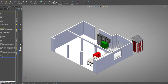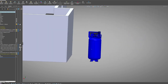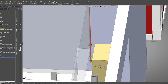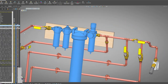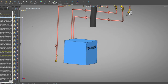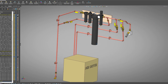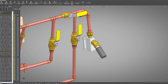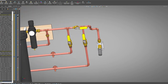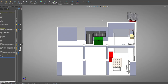Using my favorite 3D CAD program, SolidWorks, my setup starts with a two-stage 60-gallon air compressor to handle the demand for the plasma cutter. It then goes into the shop to a five-stage air desiccant filter that captures moisture, particles, and oil before it goes into the dryer. Then it goes into the refrigerant dryer, which cools the air even more and causes the water to drip out — you can compare this to a dehumidifier used to dehumidify a room. Air is then routed to an air manifold, which splits off to multiple downstream machines, one being my plasma machine.